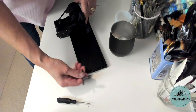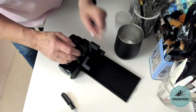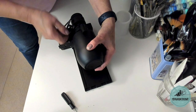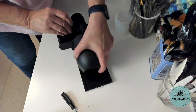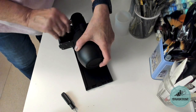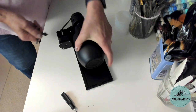So now what I need to do is use this chuck to adjust the size. And you'll see there are gear teeth here. You turn it one way to open these out wider. You can see they're coming out wider. And now my tumbler fits in there. As you keep turning it counterclockwise, these are pushed out further. And as you turn it clockwise, they're coming in closer together to grip your tumbler or whatever you're working with. There, and that's pretty snug now. That's holding that really well.